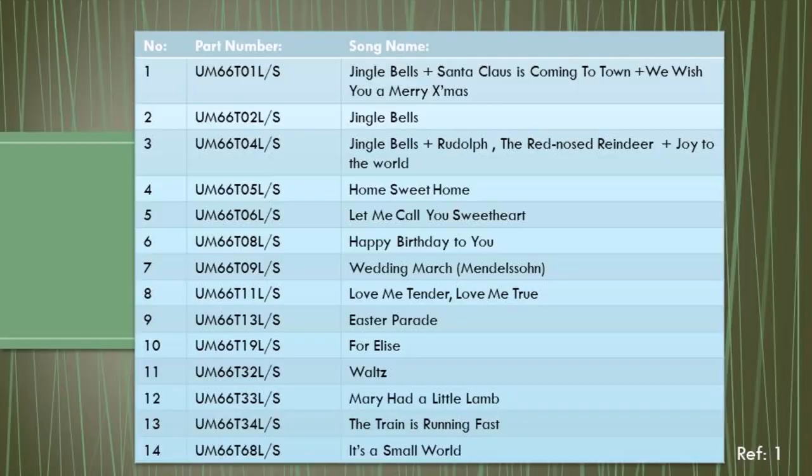When you read its code number, you can recognize the following code format. The UM66T is the IC series, after T, a 2-digit number mentioned in melody. The letter L means level hold mode, to play the melody repeatedly. The letter S is for one-shot mode. According to the manufacturer, it has code variations such as UM66, FT66 and BT66.